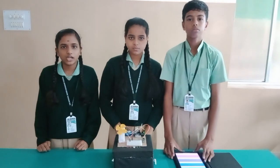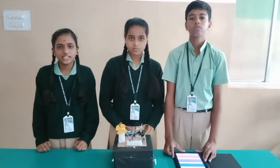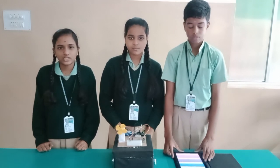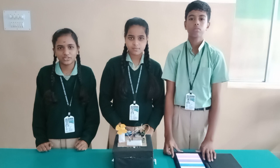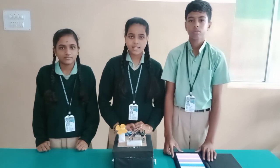Procedure: Download the app for Arduino Bluetooth Home Automation. Click connect to Bluetooth. Choose the device HC05. When you connect it for the first time, it will ask you for the password. Enter 0000 or 1234. Now it is connected. Let us try now.